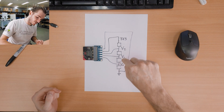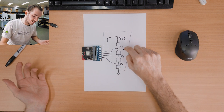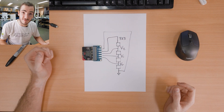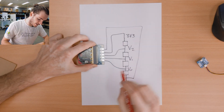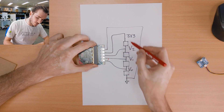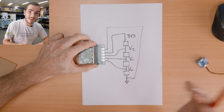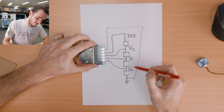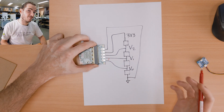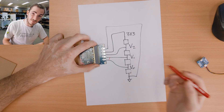All the micro:bit needs to do is look for these fixed and known voltages. This is just a big voltage divider, so it's really easy to calculate what each voltage ought to be when powered by 3.3 volts. If any of these pins develop a short — say pin zero shorts to pin one — that will change the way the voltage divider is constructed and you'll get different, out-of-spec voltages on V2, V1, and V0. V1 will now equal V0, which can never be possible, and that'll also drag V2 out because there's essentially a missing resistor from the voltage divider.